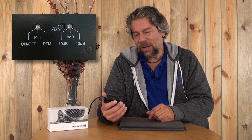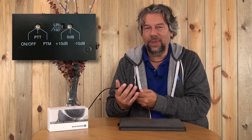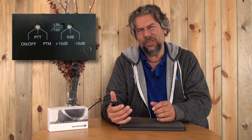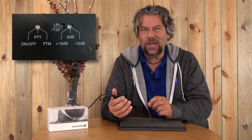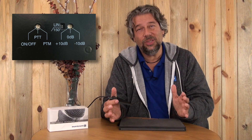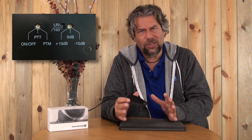In the middle there's called LIN-150 and that's an interesting one — that's actually a bass rolloff. So if you use this and you find you get a lot of bass rumble, maybe vibrations on your table surface or something, you can actually use that setting to turn off that frequency. Normally this works from 40 to 20,000 Hertz, but you might actually not want it to go down to 40 Hertz. Your conference, your legal deposition, any briefing from the CEO — it's all going to sound just as good if you don't have that 150 to 40 Hertz range. No one really talks that low.